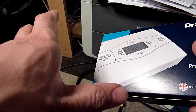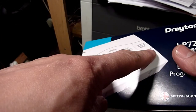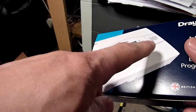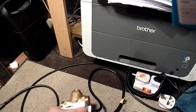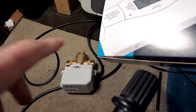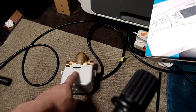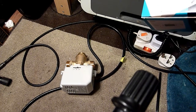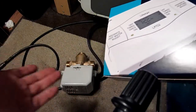Although on the boiler, if you look on the panel, there's like a central heating sign. It's thinking it's central heating, it's thinking it's water, but it's not actually doing it. It's not actually sending a signal to this thing here, which was broken, right? So likelihood is it's both, but it could very well be this thing here, it's just not advancing the arm when this is sending the signal out. It could be. So the cheap fix will be, if this is from Screwfix, about £59.